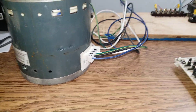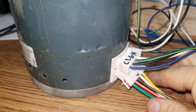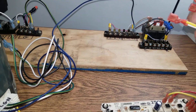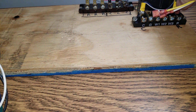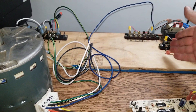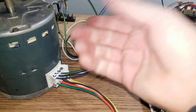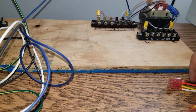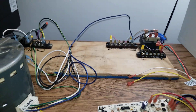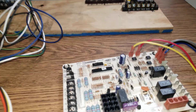Now this motor has power. Let's connect the speed terminals. As we said, there are five speeds. Number one is G — let's connect it to 24 volts. We have common connected to zero, basically the common of the transformer, and now we connect 24 volts, supplying 24 volts to speed number one — that's why the motor comes on. Let's connect the next speed, which is orange in this case. That's the next speed up, and so on. That's how you get all five speeds checked.